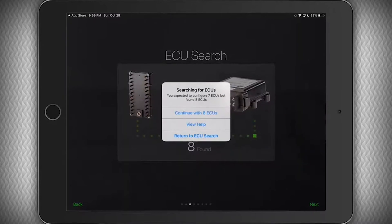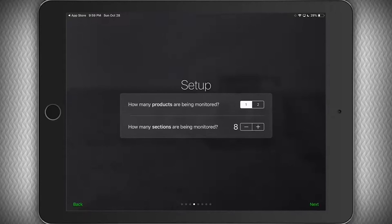If it does not find exactly the number you entered, it will tell you how many it did find and you can choose one of the options. Now it will ask how many products are being monitored — really asking if you have more than one type of flow. Select one product for single shoot drills where all product flows come out of the same runs. Select two products for dual shoot systems or systems with mid-row banders where seed and fertilizer come out of separate towers and runs. For this example, we have a dual shoot machine with eight manifolds — four for seed and four for fertilizer — so I will select two products and eight sections and click next.